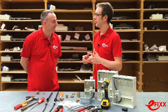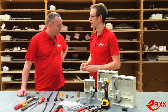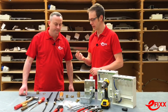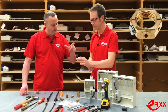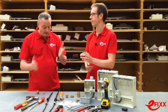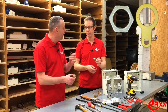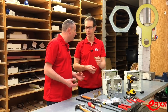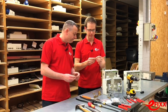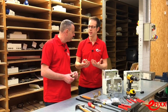In this video we're going to be looking at some time-saving opportunities available to electricians, because it's a grind making a living and we want to make life as easy as possible. We're going to be looking at the earthing nut, which is replacing the earth ring — often called the banjo on site — and the lock nut when connecting things like steel wire armoured glands to metallic enclosures. This isn't a new product; it's been around a little while, but it's always nice to revisit things.